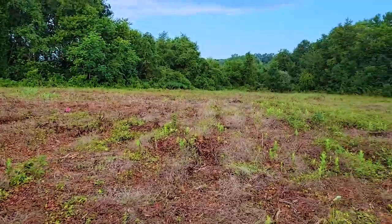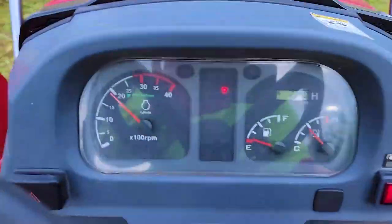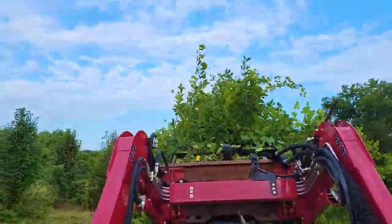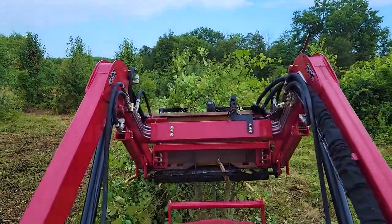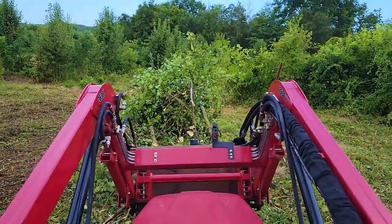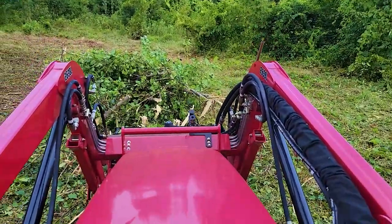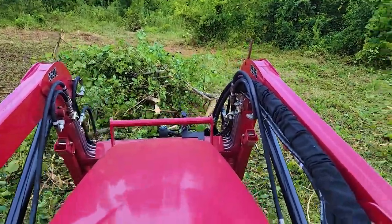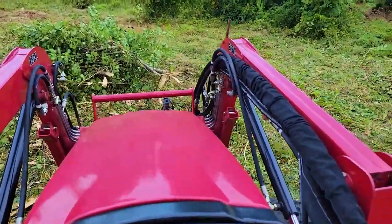I am driving my truck over it just fine now. Here's a quick demo to show you how to cut down these big trees. This one is about 18 feet tall. The first thing you want to do is bring your RPMs up on the tractor — the faster the blades are spinning, the better it handles the big stuff. Then you lift it up high enough to where you can actually chop it, because the top really doesn't matter and will break up real easy anyway. After you chop it down, rock back and forth and take six to eight inches at a time, because that actually splinters the wood into splinters instead of cutting big logs. Big logs will flop up and hit the bottom of your truck or your tractor, or kick into the deck and clog everything up and get the blades stuck.